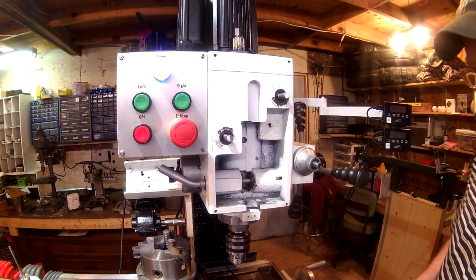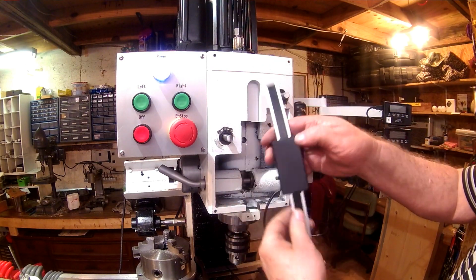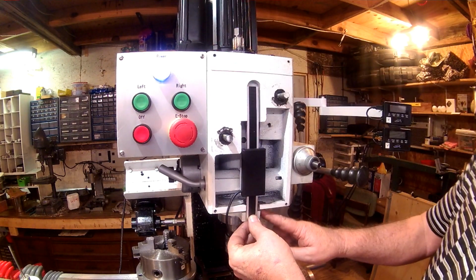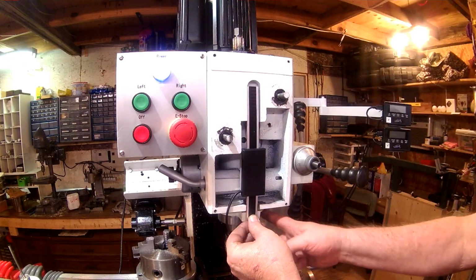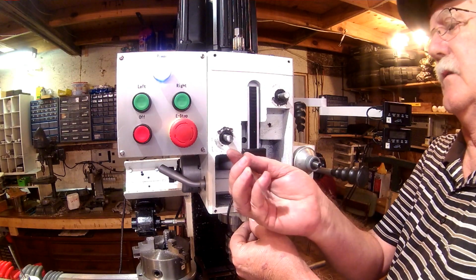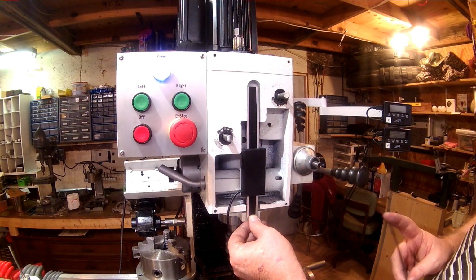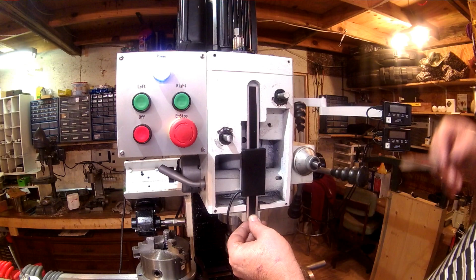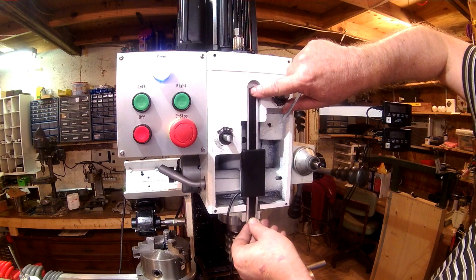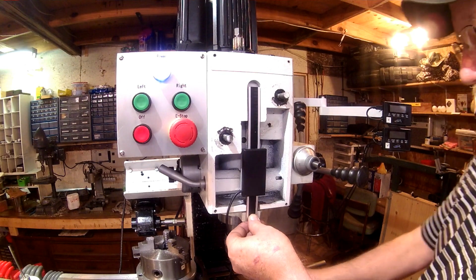In looking at the DRO itself now, setting up here, if it's mounted with the black out this way, held tight up against this bracket that's going around the spindle, I can see with the scale, there's about 200 thousandths there that is still sticking out. But in this case, the bracket would be in the back. Now, in this section up here that's been milled out, it looks like the same, about 200 thousandths up there with the scale.